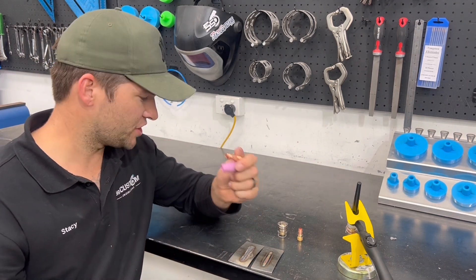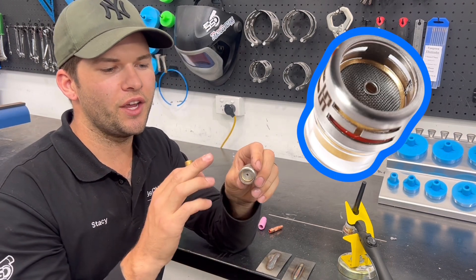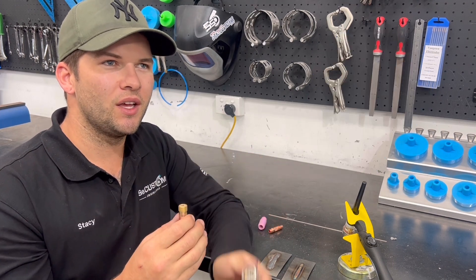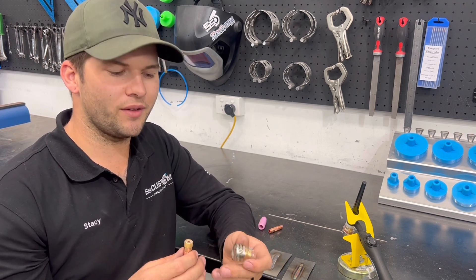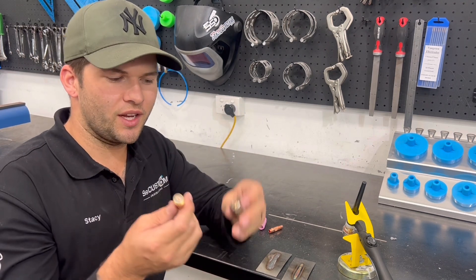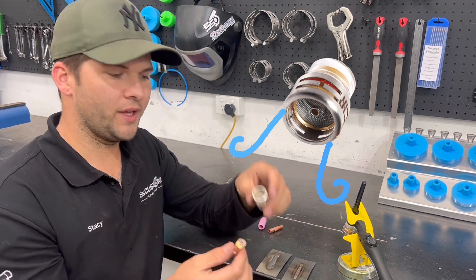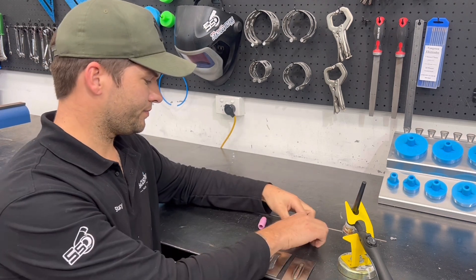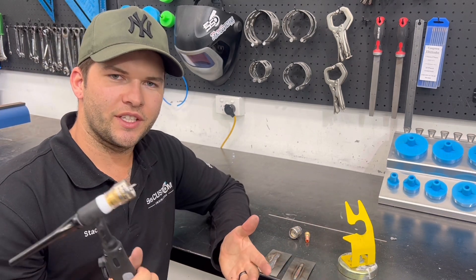Just to keep it simple, grab them and throw them, because that will nine out of ten times be why your weld looks like that. What you need to do is get online or go to your local tool store and find a gas lens. I usually run a size 10 or 12, and if I'm doing titanium I might go up to a 16. Bigger isn't always better because it takes more volume of argon to push out, so around a size 12 gets you a pretty nice looking weld. Gas lenses distribute a nice even flowing argon shield over your weld.